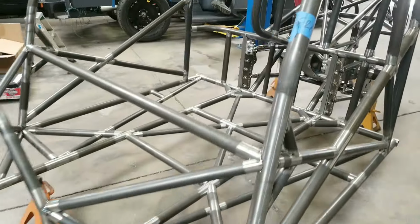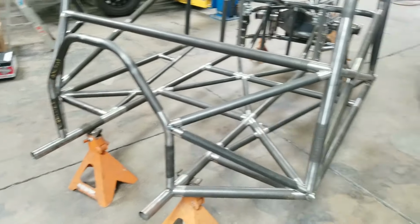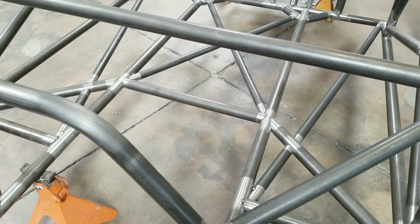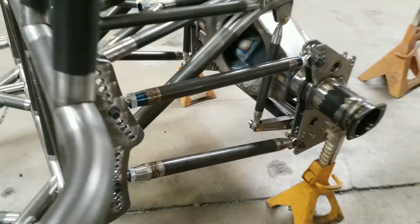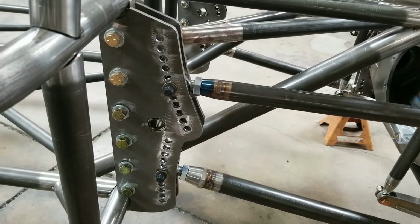This is a post car. Get the engine located where it needs to go. The Turbo 400 will fit perfect right there. You can put the 4-bolt flanges in there and make the trans cross member removable. 4-link brackets. So I made this bracket system to make it so we could unbolt the 4-link brackets.